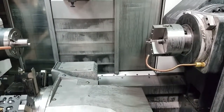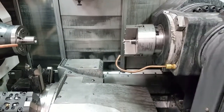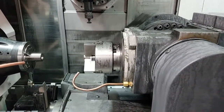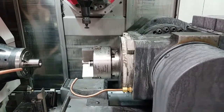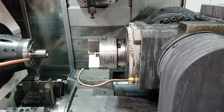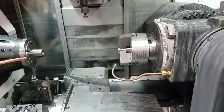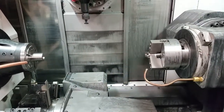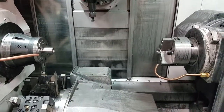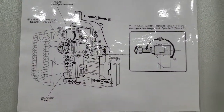This is our last axis, our 10th axis, which is the A-axis — the movement of the whole sub spindle assembly. That was an A-minus move, and then A-positive is going to go away from the main spindle. Now again, this is a lot of axes to try to remember, which is why we've given you this diagram to always refer back to when making your offset adjustments.